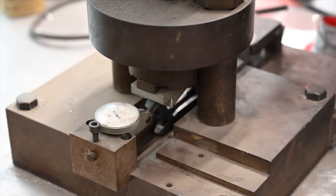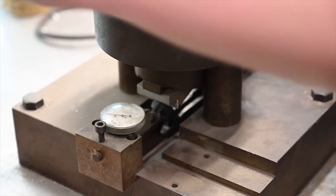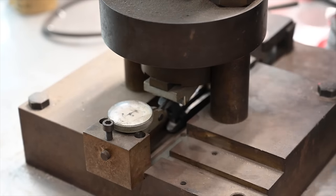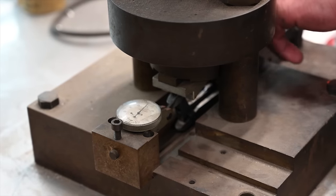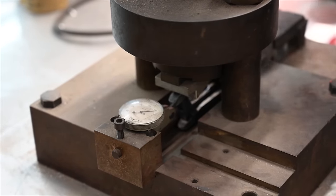Of course. So we just asked Lionel what this curious machine does, and it has an extraordinarily specific purpose. Tell us about it. Right, so that will help us to right the bending to the back tang of the receiver on the 20 gauge. It will give the right angle to make sure the drop further on the stock will be correct, but also the right arch shape to make sure all the moving parts have enough room and work perfectly inside the receiver. So it's not only the gap between the top and bottom, it's the curvature. Yes, and the relationship between the two. And that's all that machine does on one gun. Yes. And then to make it perfect, you have to refile it, to make sure it looks perfect. Extremely specific tooling.